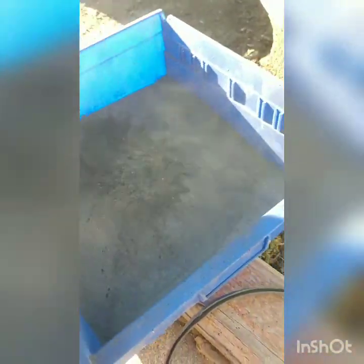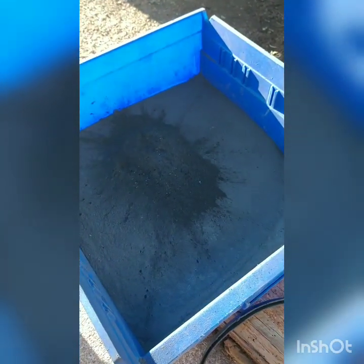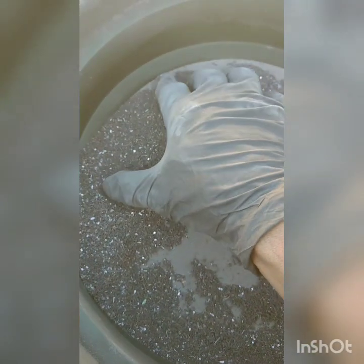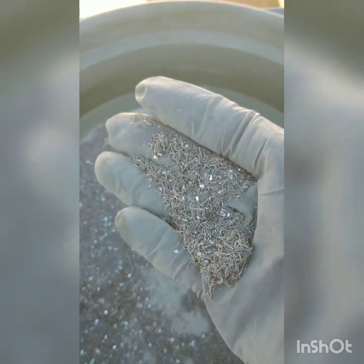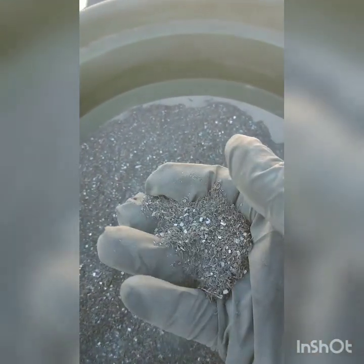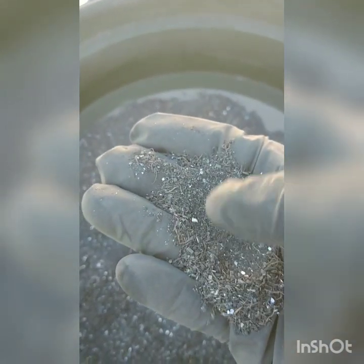What's left I will put through my 100-mesh classifier and show you the results. The material that does not go through the 100-mesh is pretty much all your iron, some shiny pieces of silicon die, and just a little bit of chip balls — pretty small.